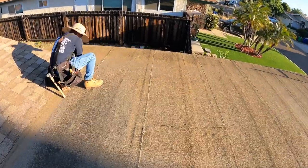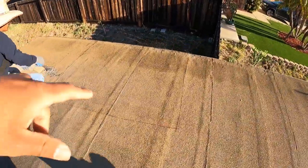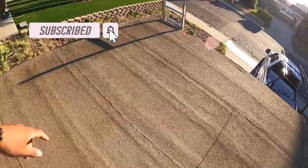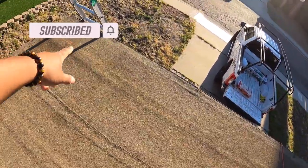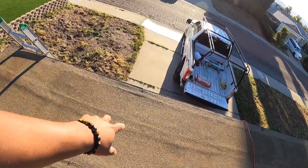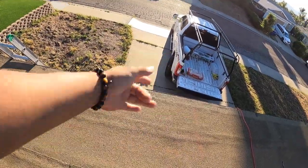We got a torch repair today. Got bad wood here in this area. Take off this. Then we got bad wood right here. Take it off. Take off the wood. Put new wood. Come back with exactly what's already on this roof. Put new drip metal. Give you that process and show you how you do it. So we're gonna get started here. Let's get you on the roof.